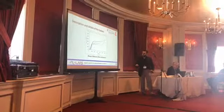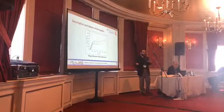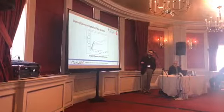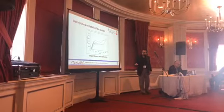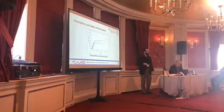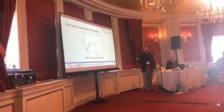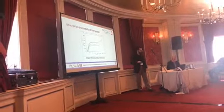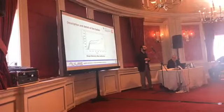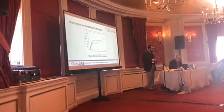Before I go into the details of the system and the experimental program, the main component that this system works on is shape memory alloys, which have behavior such as you see here. If we look into the stress-strain behavior of SMA, as you can see, after a certain yielding point, it goes to a super elastic range where it can take lots of deformation. The specific type used in this research is nitinol, or nickel titanium SMA, which can have 6 to 8% of recoverable super elastic strain. So after removing the load, it will return to its original shape.